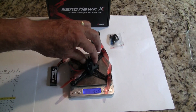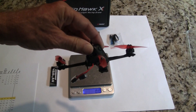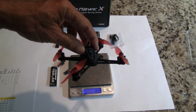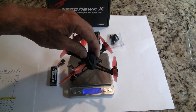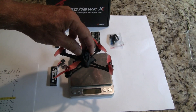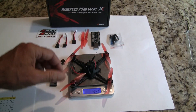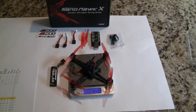Here are some of the components on this. For the camera it's the Nano 3, a lightweight camera that's fairly good quality. The ESCs and flight control board are Emax's board — it's a 5-amp board, the same one on their other Nano Hawk with the hoops, and I have not had any problems with it. I haven't burnt the ESCs yet across about 40 flights. The motors are a little bit bigger: 1202.5 motors at 11,000 kV, a nicely balanced size for these props on 1S — it works great.